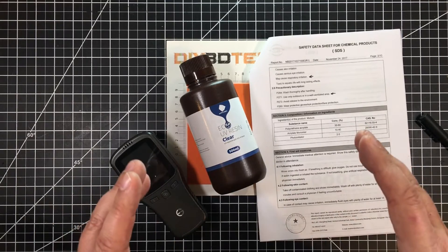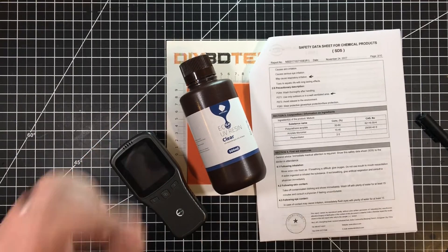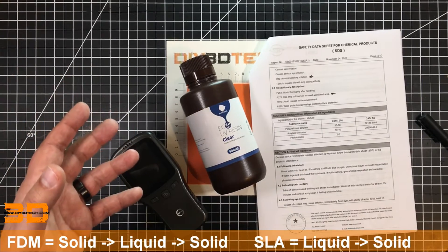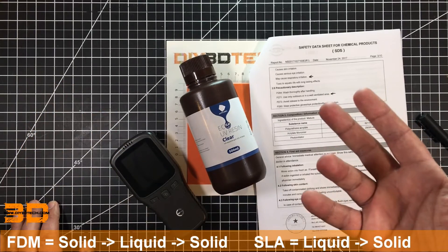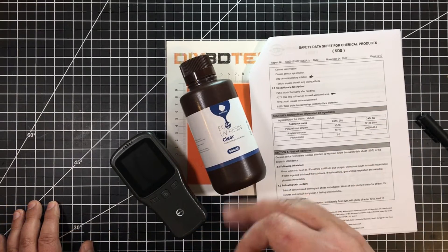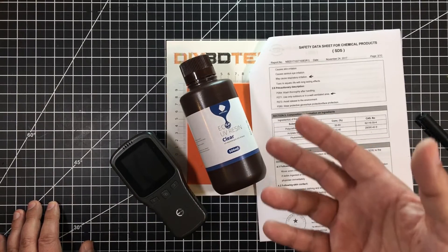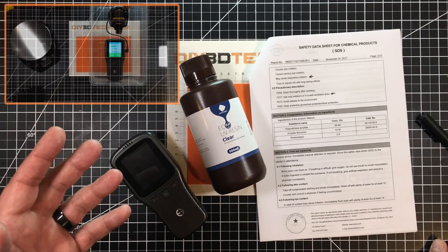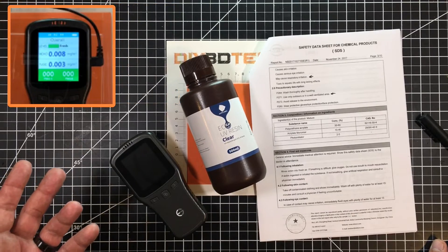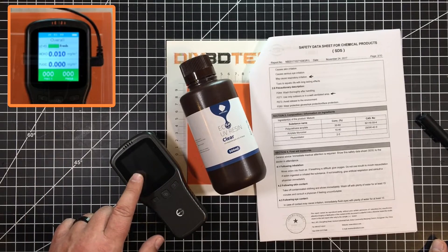What I actually did is I built up a test jig. Testing SLA resins is a little different than FDM — with FDM you're heating something up and partly aerosolizing it, but with an SLA printer you're simply using UV light to cure a layer of plastic to the previous one, so you're not heating or aerosolizing it. So I designed a simple containment chamber, placed a measured amount — in this case 13 grams of the material — in there with this air quality meter. I was actually very surprised at the results.